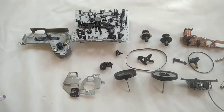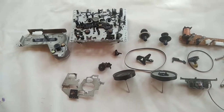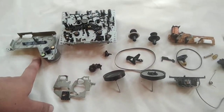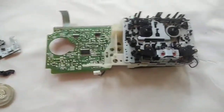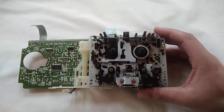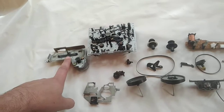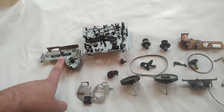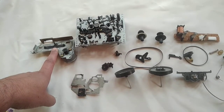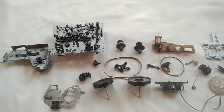I have disassembled the cassette mechanism of the deck. Here are the components of the cassette mechanism. This is the recording side of the deck. I have repaired it and cleaned it thoroughly. The A side was playing fine, but when you switch to the B side of the cassette it just stopped playing. I disassembled and thoroughly inspected it, and the main problem was this little rubber gear.